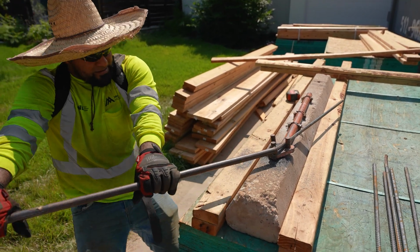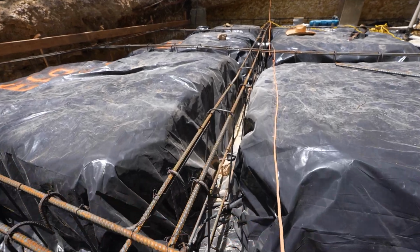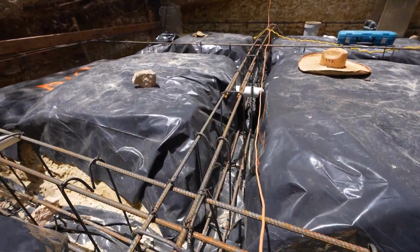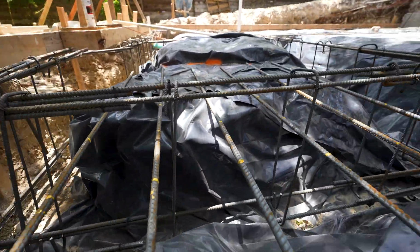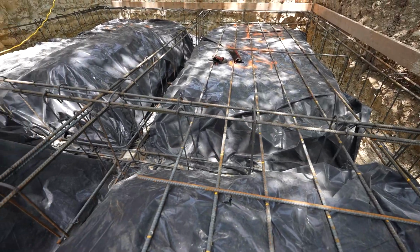They want bricks on the bottom that hold that rebar off the ground. They want depths on your grade beams. All the information's there. And then guess what? After you get the rebar in, you have the engineer come out for a pre-pour inspection, and they're gonna check all of this stuff. So they're a safeguard to making sure that you're doing it right.